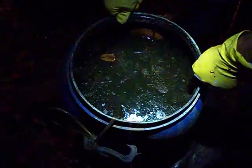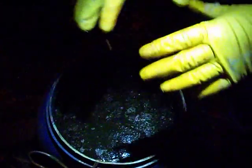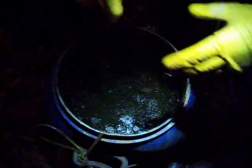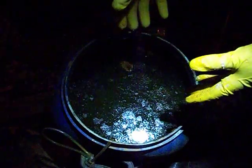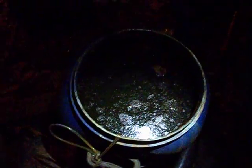This is just about ready. I have other settling tanks — I have a tank that's kind of like a stock pot where I keep pieces of copper hanging in it. As I pour the solution in, anything that the copper can settle out does settle out. After I'm sure there's no more precious metal in it, I move it into a tank like this one, put a piece of iron in it, and repeat the process. So I'm using copper to get the precious metals, then iron to get the copper.